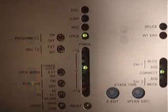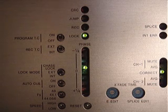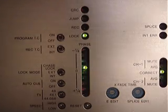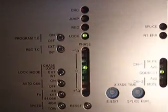There is another signal recorded onto the tape. This signal allows the recorder to digitally track the tape. The phase shows the correction between the replay of the tape and the signal reproduced. The phase difference is very similar to what's known as wow and flutter on an analogue machine. The recorder uses the digital signal to correct any kind of problem so that the wow and flutter is kept at very minimal.